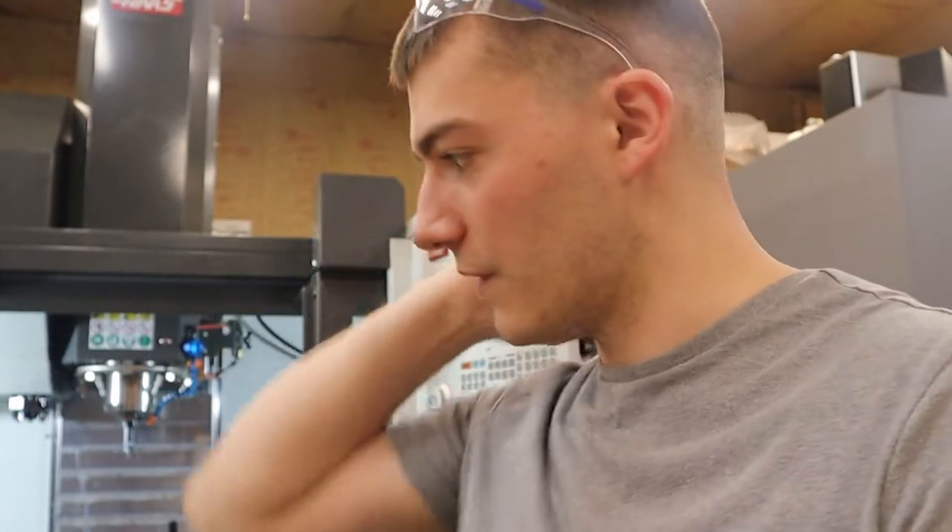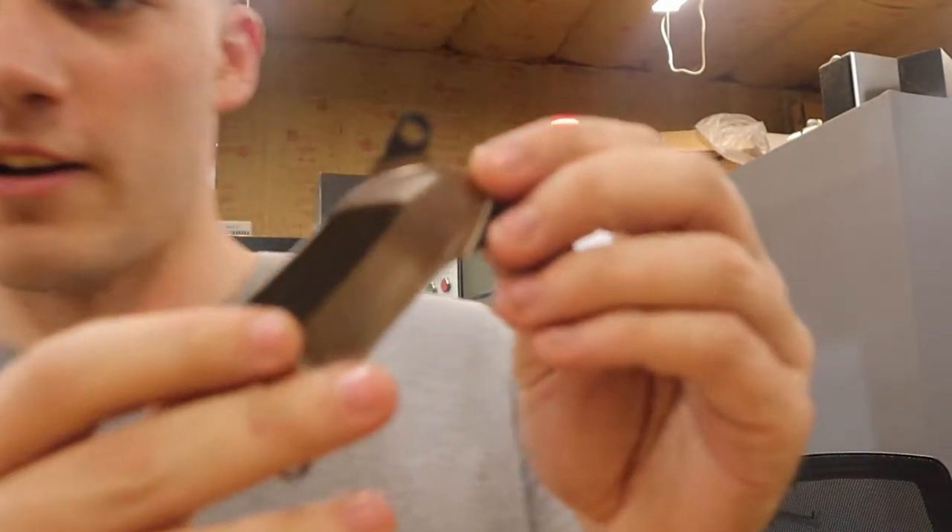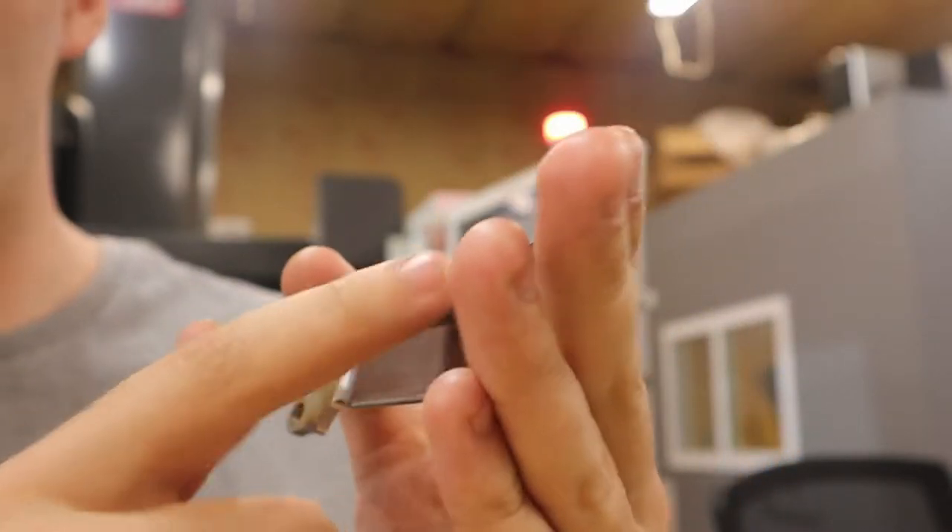In the last update video I talked about how I'm hard milling the proper way now. Before, the blade would sit on the plate and I was using cutters and coolant to hard mill, and it would take like two hours and 40 minutes just to rough that profile out — not the smooth part, basically just rough it enough to come by with a parallel operation and clean it up. I was like, I'm pretty sure I'm doing something wrong.